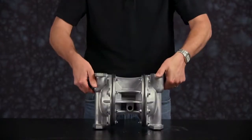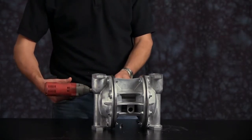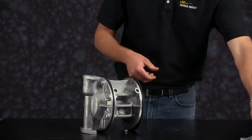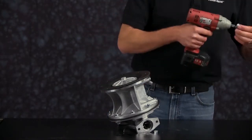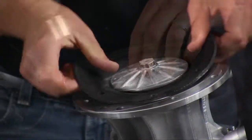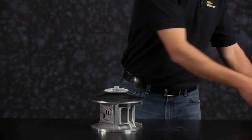Remove the discharge check balls and discard, and set aside for later reassembly. Leave one outer chamber on and we're ready to remove the opposite diaphragm assembly. Here we have the diaphragm assembly with the diaphragm rod — set aside and remove the opposite outer chamber. Once the outer chamber is removed, set aside for later reassembly and remove the second diaphragm assembly.